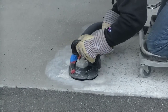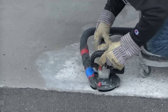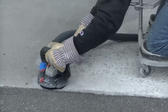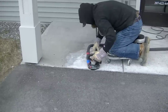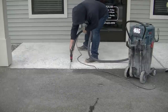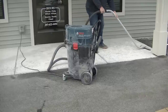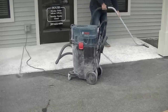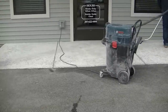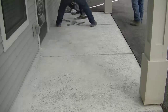What we do when we repair and resurface concrete is lightly grind it. Anything that's intact and bonded — any part of the surface that's in good shape — we'll know within seconds of going over it. Anything that isn't will just disintegrate under the grinder. We use a little five-inch Bosch grinder hooked to a vacuum, lightly grind over the surface, clean it up, and then we're ready to do our repairs.